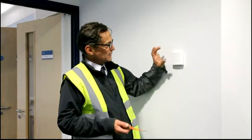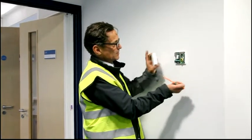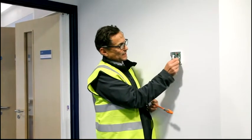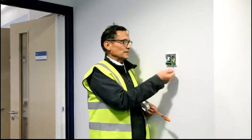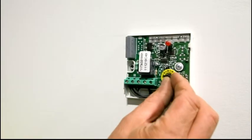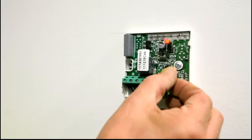Part of the underfloor heating system is controlled by a sensor. Each location and area will have its own sensor. They are tamper proof. To get them off you prise the two little tabs on the side, pull away, and inside you have a stat which can be moved to set the temperature. These are generally set at 19 degrees. We turn them up — that's gone up to 26 — the lights come on which means the heating system is engaged and it's calling for heat. Turn it down and it goes off. We think it's quite comfortable at 19 degrees. On the underfloor heating the little indicator lets you set 19 degrees and click it up to get more heat or down to a lower temperature.